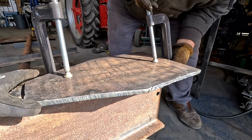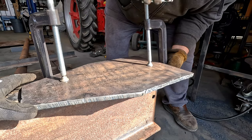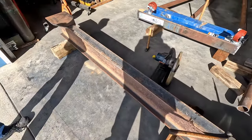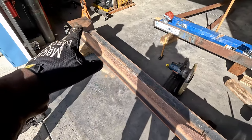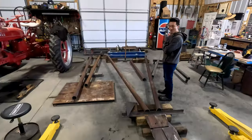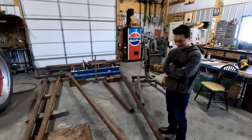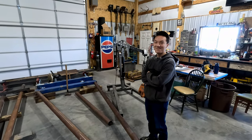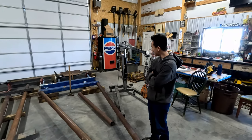That's going to be in the way, but we can move it and switch sides on it. We're going to have a seven-foot working distance here, which is plenty — we don't want to be picking things on the edge of the crane; that's where you could get a rollover. We have David out here to help us weld again today, this time for real, because last time he got stuck on the torch and we never really got any welding done.